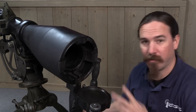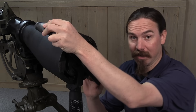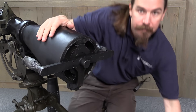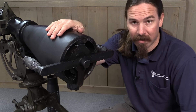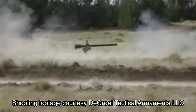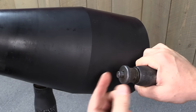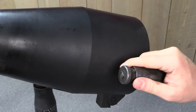This one's got a bunch of preservative grease inside, so I'm not going to try and chamber an old empty cartridge. Once you've got that in, you close the breech block. What you would do is get back here so that you are not behind the action — close it, rotate to lock. I can't really overemphasize just how dangerous the back end of these things is. Literally as much blast comes out here as comes out the front end. Once it's locked in position, the trigger is right here on the left hand breech handle — a button with a safety device. You rotate this: that's safe, that's ready to fire. Hear that click — that is the firing pin dropping, and that sets off a tremendous kaboom.